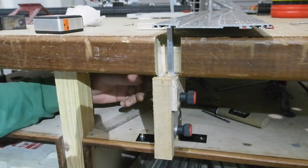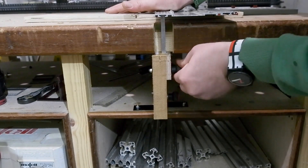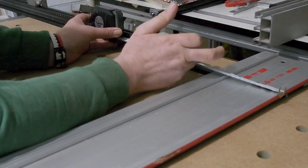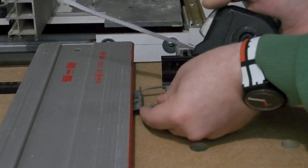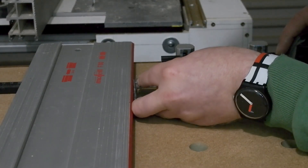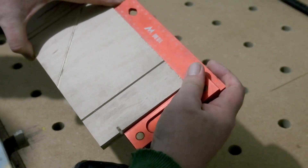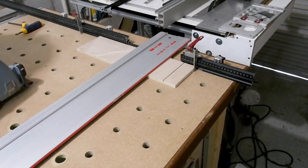The very last thing to tweak is fence position. Because I can, I set the height front and rear to a piece of 12mm ply, then loosen off the fences. I have a star knob on the short wayside fence, and double up — screw top and bottom hex bolts in the fence dogs — for the main fence. Using the single star knob fixing option can mean your fence dogs get knocked when moved or stored; doubling them up with proper bolts holds them fast. For setting the scale: no fancy trick, just a tape and tapping it this way or that. For the right side fence you have to allow for the blade curve when setting your scale — you can use the saw blade itself or, if you have one, a wayside jig as I have here.